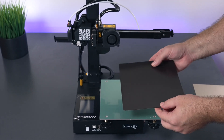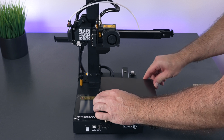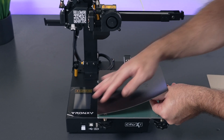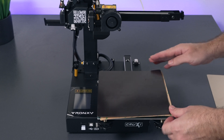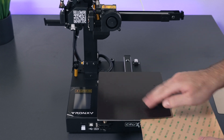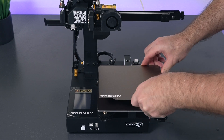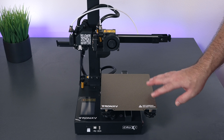I'm not very good with this kind of stuff so if you're not either, be very careful because you get only one try. I'll peel it from one corner and lay it down, making sure it's square everywhere. Once I'm confident it's reasonably straight I'll start peeling the whole backing and laying it flat. Since this sheet is so thick it's not that hard, but take your time and let it set from one end to the other. Now our PEI sheet magnetizes right on top - very cool to have this PEI option.